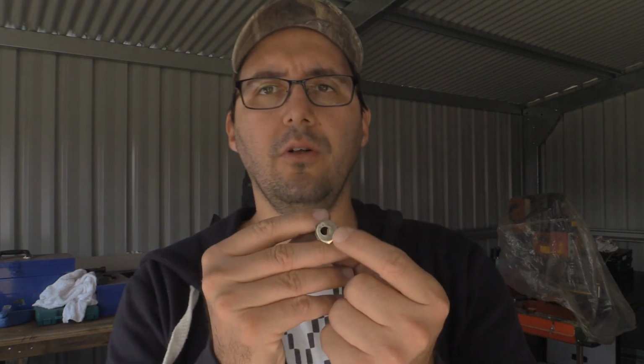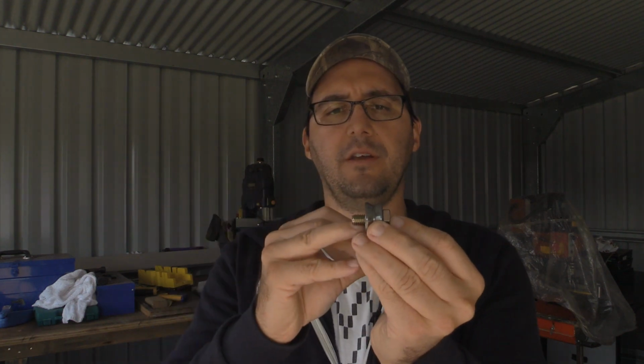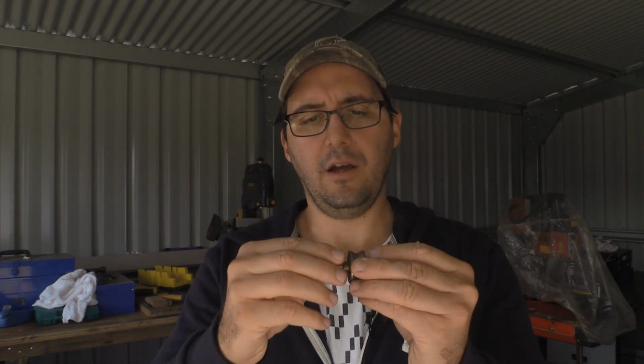And then with the concentric bushes, or your standard bushes, instead of trying to drill a hole exactly in the centre of the bolt, all I'm going to do is drill out, instead of a 1/4 inch hole, a 10mm hole, an M10 hole. So a 10mm hole, and then the whole bolt will push through the carriage, and there'll be a spacer in here, and then that'll just screw on like so. So that's the idea for the mounting of the V bearings onto the plates.